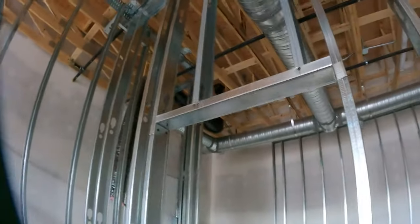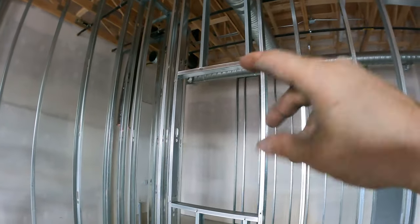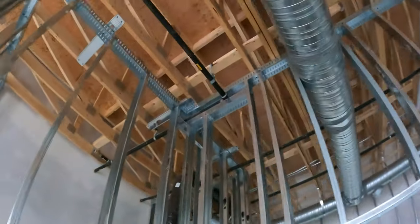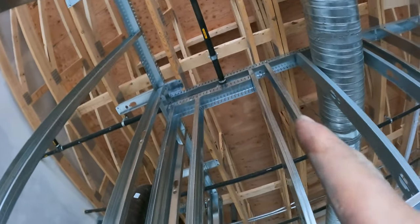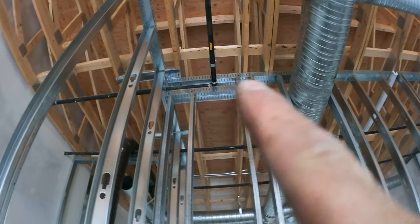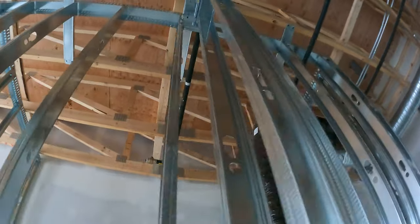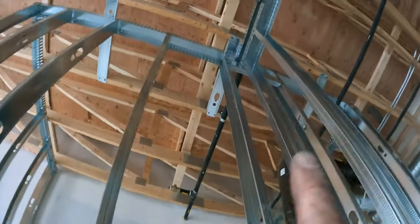This opening is for a digital soup screen — they have a digital menu here, and I'm going to drywall-return it with drywall across the back and at the top. Where it ran into a pipe, I just put a header across to the stud — it doesn't have to be slip track there, but I wanted to use it. I put a clip on this wall and a clip between the two studs on this side to catch the track at the top.